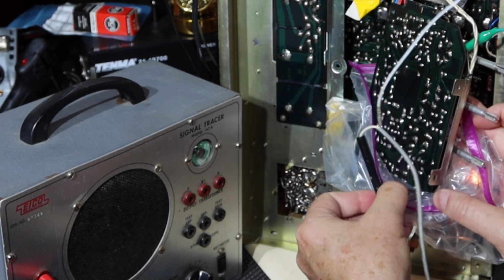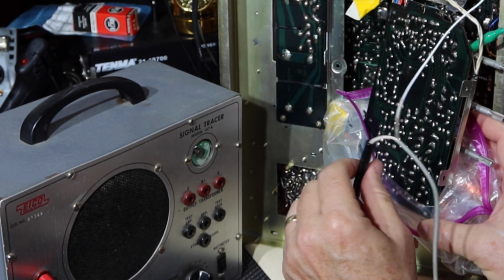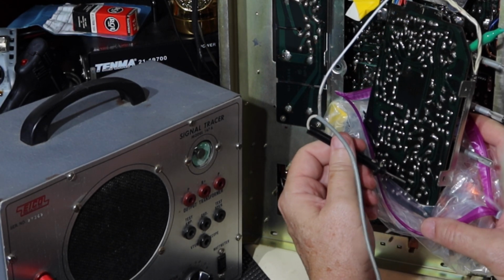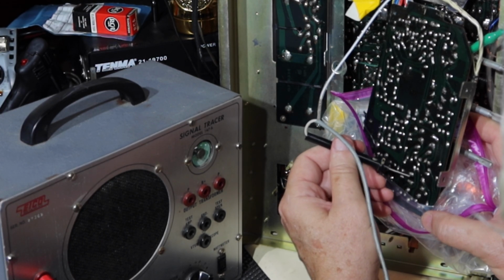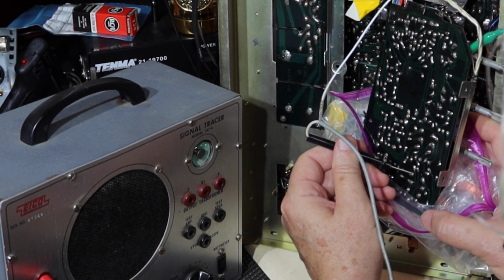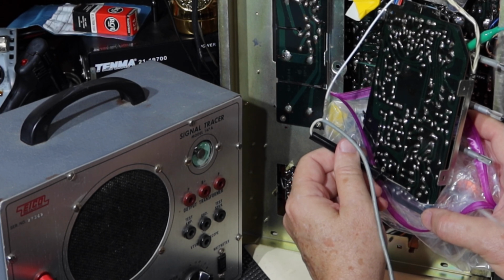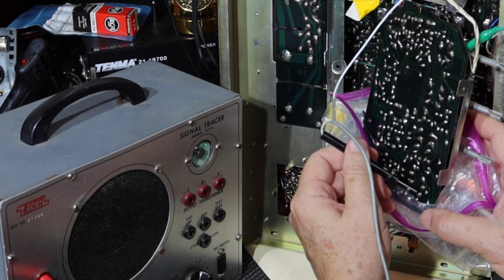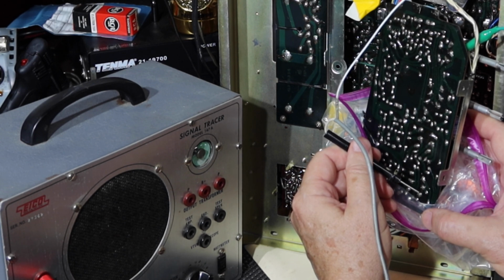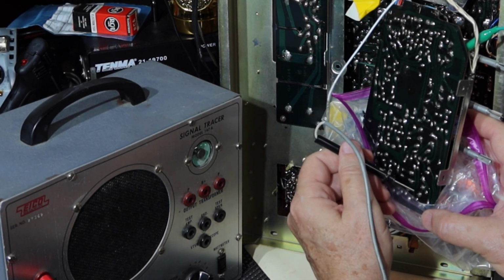Let's go down to the treble. That was my finger, being a big antenna for 60 hertz hum in the shop. Okay, so here's 6 terminals right here. This is the treble control. And so these are for one side. Let me do these 3. Nothing. Nothing. I hear a little bit of something there. Try this one. Nothing. Nothing. Oh wow. Hopefully you can hear that. I hear it a little bit on this one, but it's not nearly as loud.